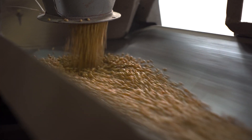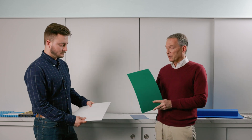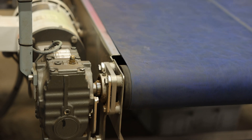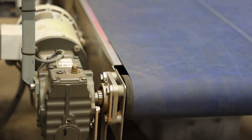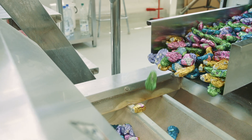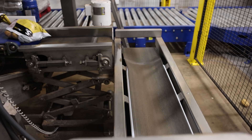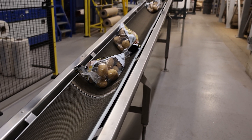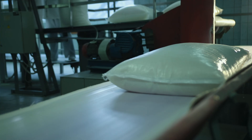Following our tabletop belt is our fabric belt. These are traditionally used in light duty to very heavy duty applications. Great for tight transfers — the thinner the belt, the tighter the radius it can go around, which means you get a very tight transfer with small objects. Also economical, so you can move product for a very cheap dollar-per-foot cost. You can get these in both endless or laced styles so that they're easy to take off, using either metal lace or clipper lacing to make them endless.